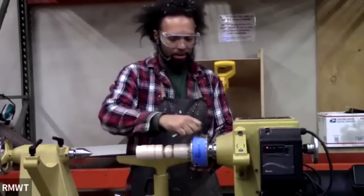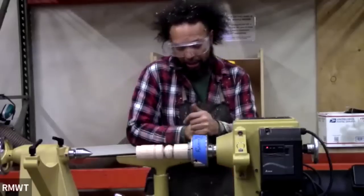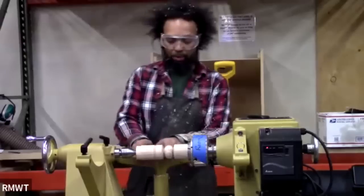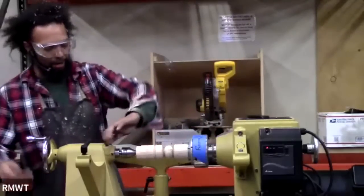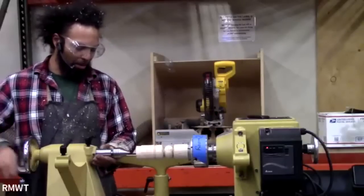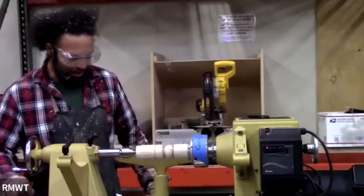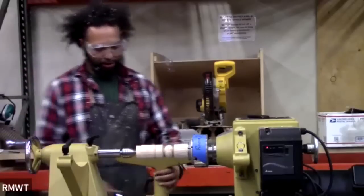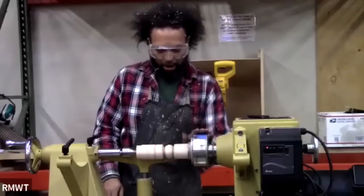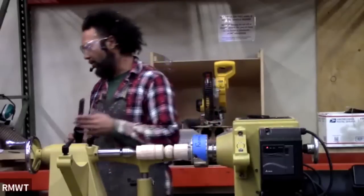And let's go ahead and do this. Now this is a bit far off away from the chuck. And so what I'll do is go ahead and add a little bit of tailstock support for now. That'll be good because it'll allow us to effectively turn this into waste by way of showing a peeling cut, okay? And I'll actually go ahead and reveal a little bit more tailstock quill. That'll allow me to have a little bit more access with the tool rest. So that should be okay right there. Close enough. And lo and behold, we're just about there. That looks good. So now we'll take a look at cutting across the grain. And why don't I sharpen this up? This is a good time to sharpen up, and I'll go ahead and do that.